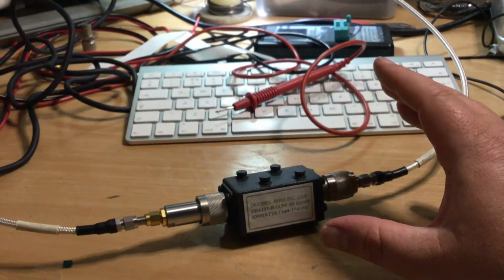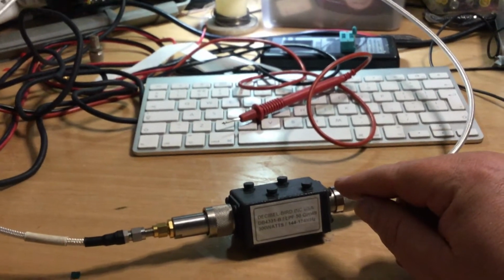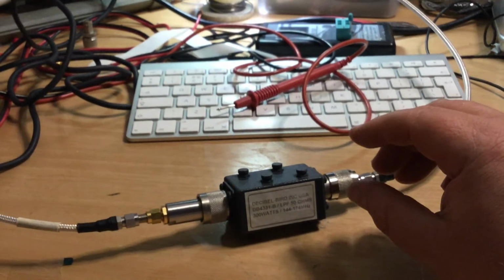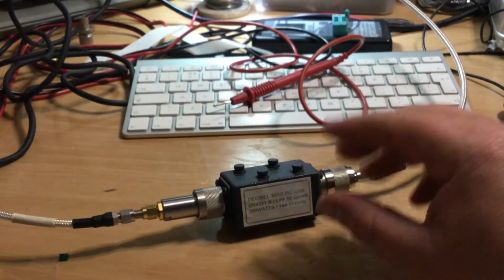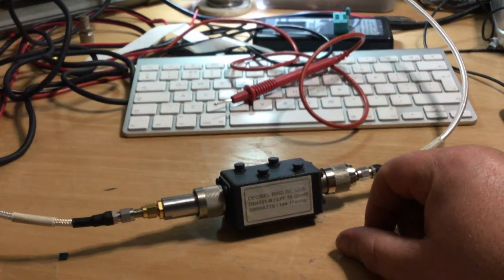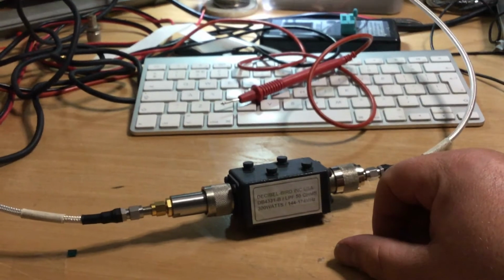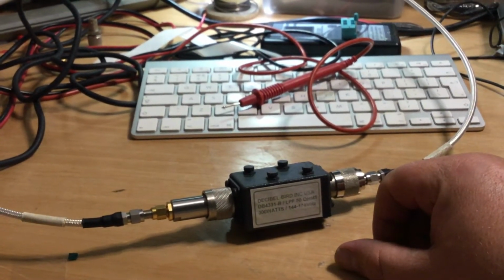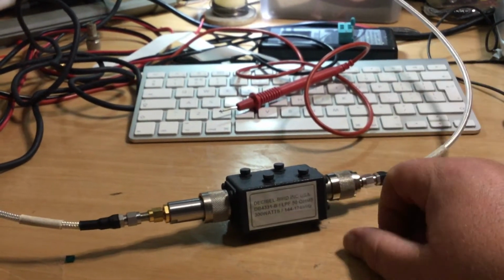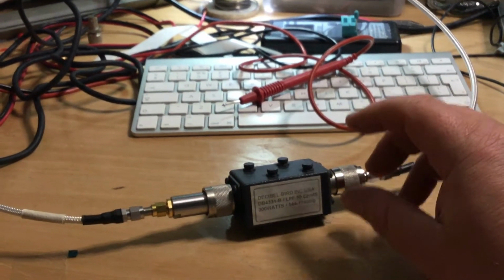When they design radios, amateur radio transceivers, or PMR radio transceivers, for example, the radios are designed with the bandpass filter circuitry within the radio transceiver, so that it meets the specifications of the regulatory bodies of the country where that transceiver is going to be used. So it doesn't cause interference to the users, basically. However, when you buy a separate amplifier, for example, a linear amplifier available for CB radio or for amateur radio, made by companies like Benos and other popular manufacturers, they do have some bandpass filter capability in them, but it's not inherently good.